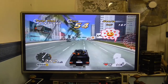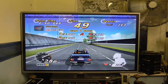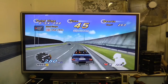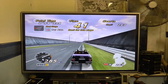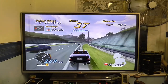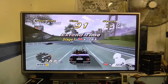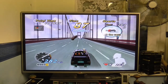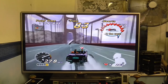Okay, well, that just about brings us to the end of this video. I've been inside this TV again, and I fixed that little problem with those two bright spots on the screen. A couple of the lenses had come unglued, so I just glued them back in, and now it's working good again. The only issue is that there is a slight bit of a shadow where I replaced that LED, but you only really notice that on something that's purely white, so it's barely noticeable.